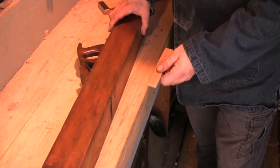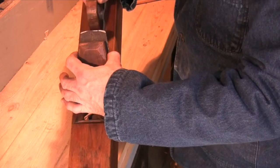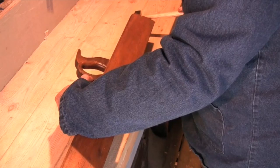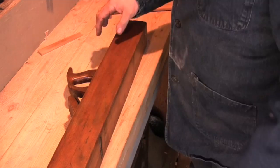As you can see here it's biting just a little bit too much. To raise the plane iron, I reach around the wedge, hang on to the actual iron, and then drive the body of the plane forward. Hanging on to the plane iron gives the blade a little more inertia and really reduces the amount of hammering needed to adjust the plane.